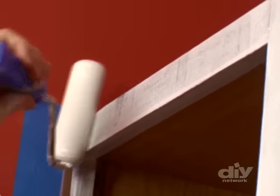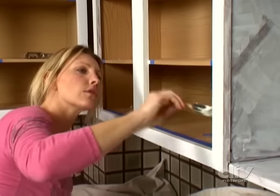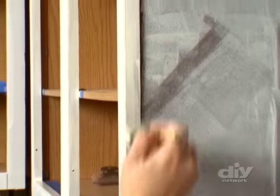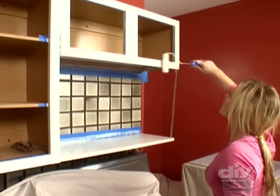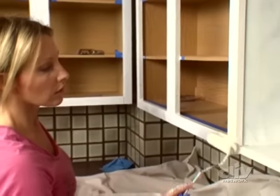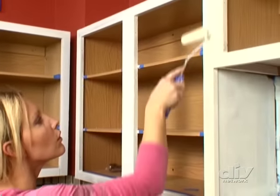The primer is finally dry and now you're ready to take it to the finish line. Start by painting the inside edges and openings of the face frames first, then the outer cabinet sides, and finally the face frame fronts. This allows you to work quickly in the less critical areas and enables you to see and correct any drips or smudges on the most visible areas.